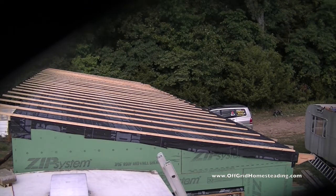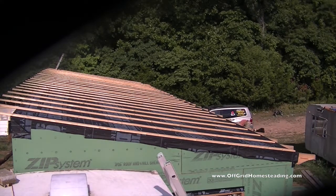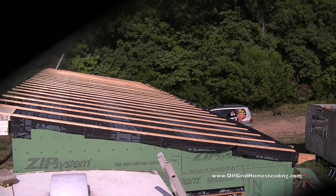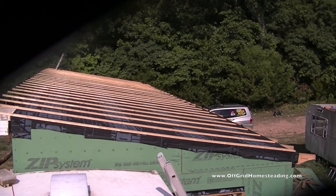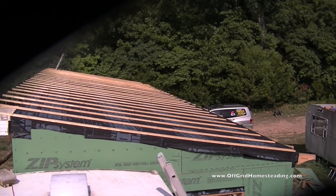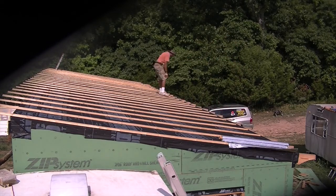Taking a look at the roof right now, you're seeing the synthetic underlayment and the purlins that run north to south. When putting on the metal roofing, the purlins actually need to go east-west. To do the radiant barrier you have to run the purlins vertically, which is a good approach because as heat is generated from the sun, that vertical channel through natural convection allows heat to move up and cool that area, making the barrier more effective.